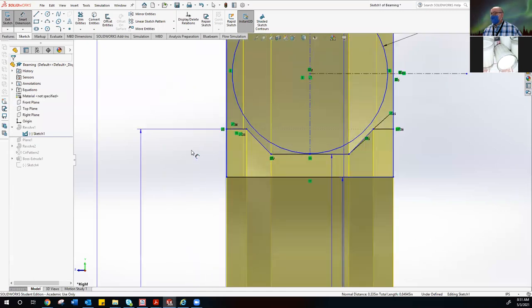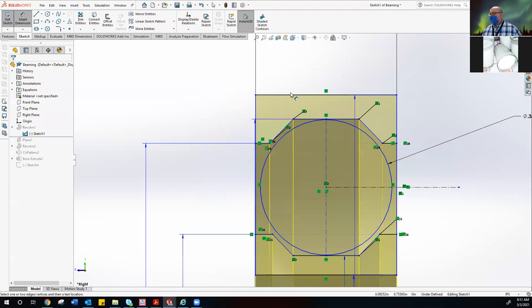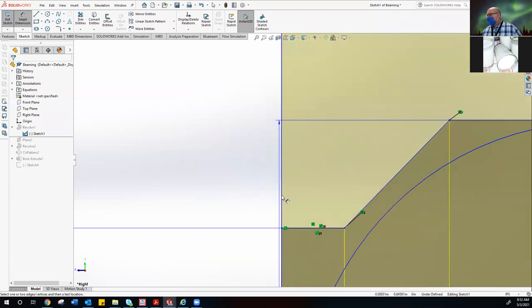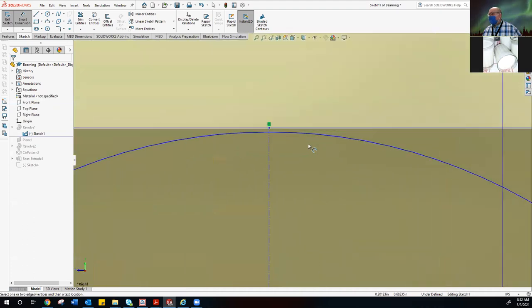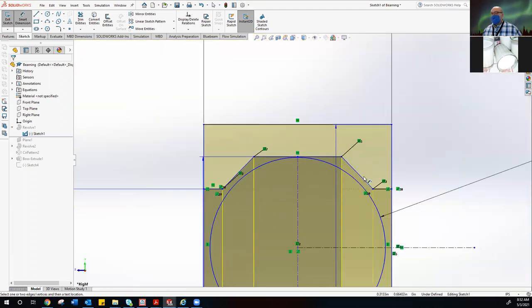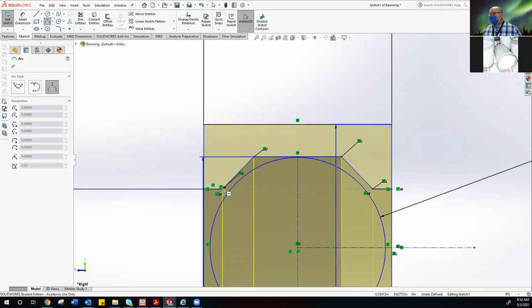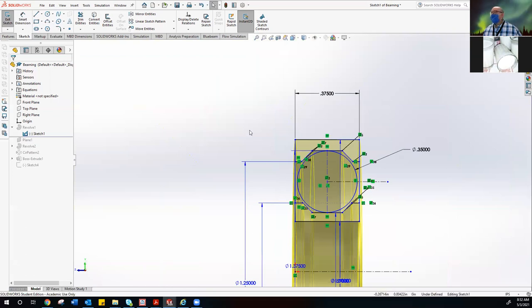The important thing on the armature is I start at the top and work down — this top line is black, then it comes down and over. This area that makes up the channel is a little vague: between your bearing and this wall you must have 0.02 clearance. You must have at least 0.02 — super important. If it's any closer than that, it'll never spin; they'll bond together and weld. This diameter of 1.25 is what keeps the bearings from falling out. If you don't have that housing on there, those bearings will fall out.